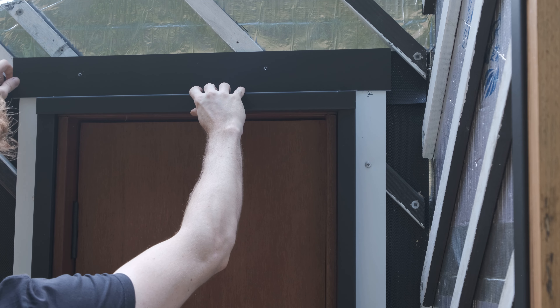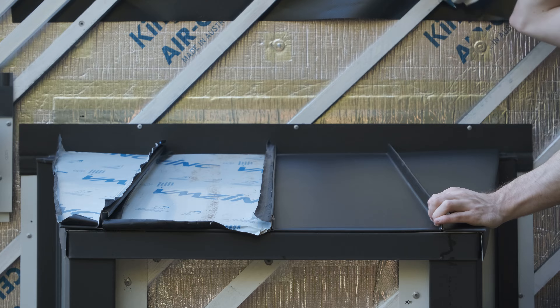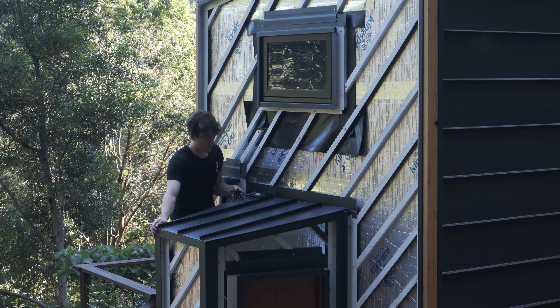I'm using an old t-shirt to help protect the metal panels from scratches from the folding tool. This type of panel can either be folded over once for a single lock or twice for a double lock — a double lock is better for weather protection and that's what I'll do for the majority of panels. However in some tight spots where I can't get the folding tool in I'll have to make do with only a single lock. The tool I'm using can actually do both locks by turning it in the opposite direction after the first fold — usually you'd need two separate tools. These tools are ridiculously expensive for what they are, so I don't mind saving some money by just having the one.